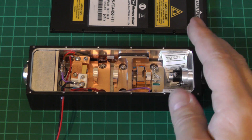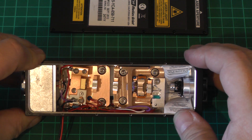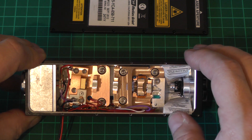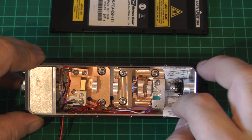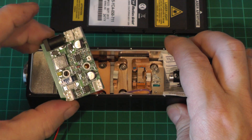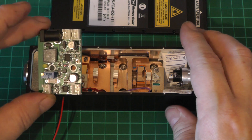It is important not to run unknown diodes like this off benchtop supplies. Benchtop supplies are notoriously noisy unless you have a really high-end well-conditioned power supply, and when you turn them on you can get current spikes which could well destroy the laser diode. So I'm actually going to use a small laser diode driver that's been designed for the purpose to drive this today.